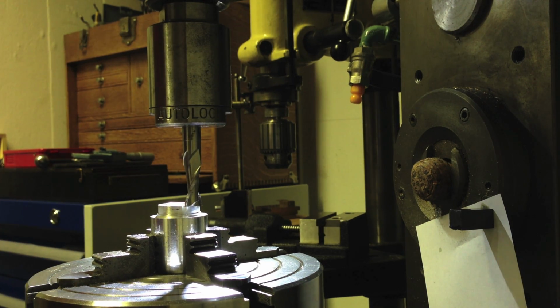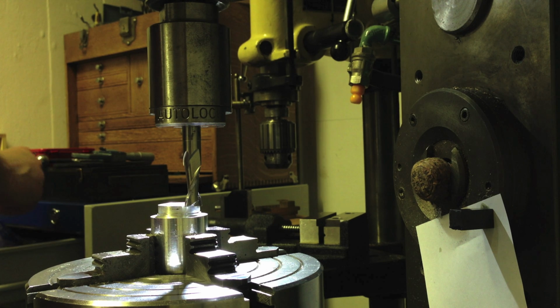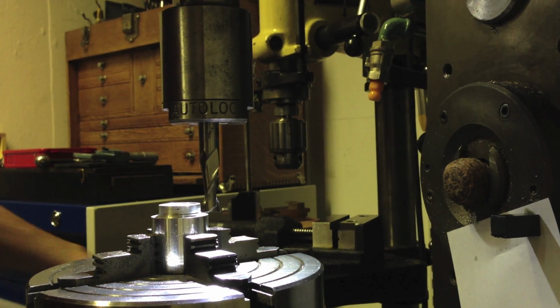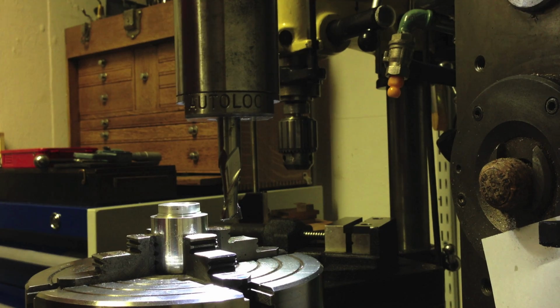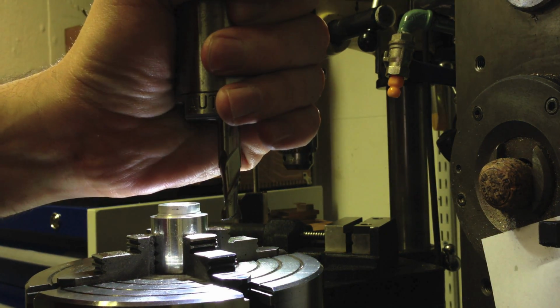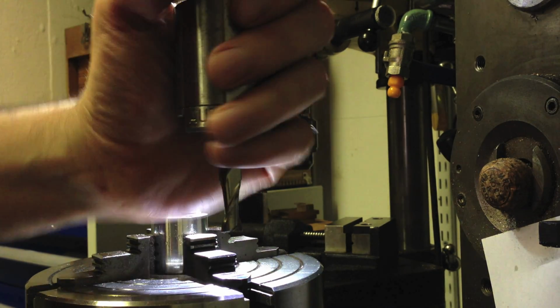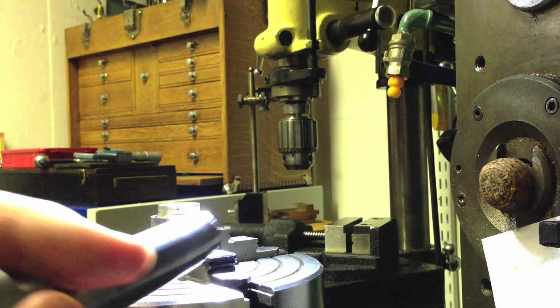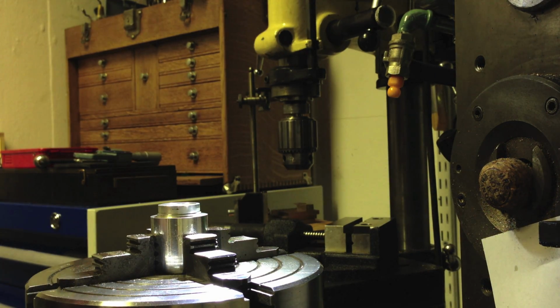This is not a good way to work. Okay, I'm going to have to do a classic center finding exercise and work properly, because I can see this all ending in a bit of a disaster. Just going to change, get the old hammer. Right, I'm going to take this milling cut out and replace it with a center finder.